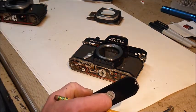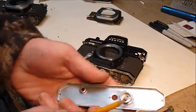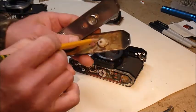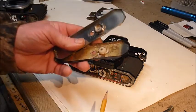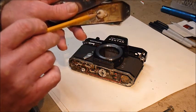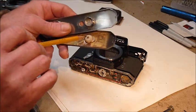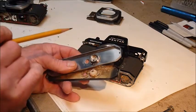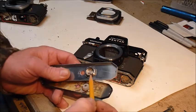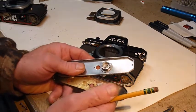Here's a busted one — this is what the inside looks like with this part removed, which is not supposed to come out, so don't try to make that happen. You want the inside of the battery compartment to be really clean, and that little contact on the other side has to be clean also, and the bottom has to be clean. If just wiping them off doesn't clean them up enough, I've used brass polish, silver polish, anything like that — applied on a Q-tip to clean contacts and get a layer of crud off. I've had really good luck with that.